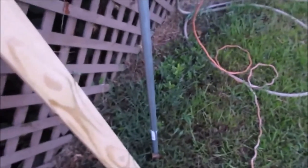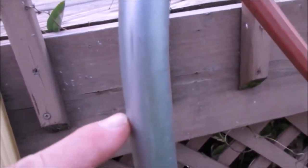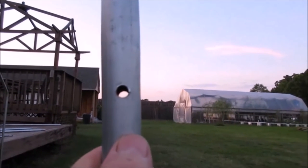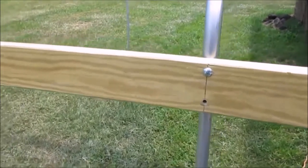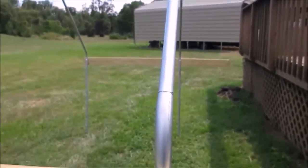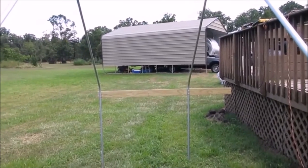From the bottom I took a tape measure, put it on the bottom, and came up to the topmost part that did not have any bend in it. From the side I went with 44 but that was coming into the bend just a little bit, so I dropped it back down to 43 and marked all four of the ribs. Then I drilled a hole through the rib - once we have one put in and tightened down we drill the hole all the way through with the second one. Both sides up here are done and secured with two bolts on each rib.